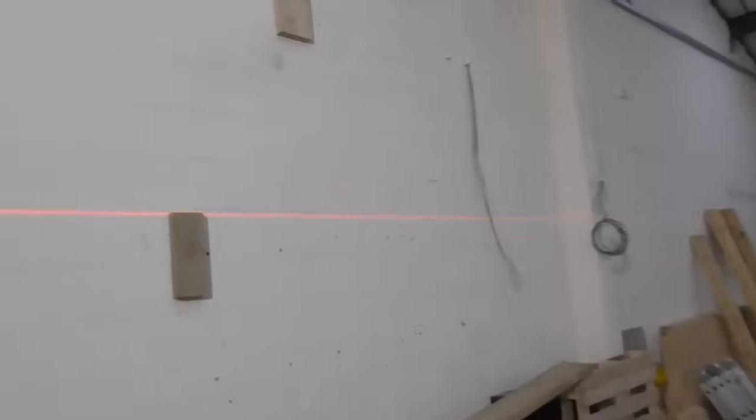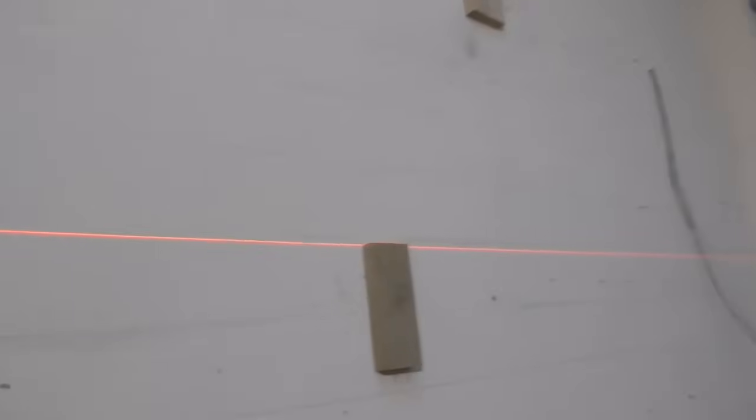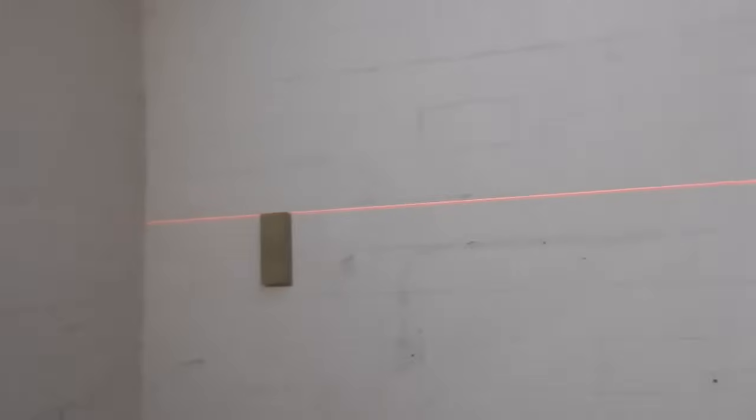Once we've done that all the way around, we'll come back and find the right positions to drill, because obviously we don't want to hit a perp joint or a bed joint with our resin. Then we can drill out for the resin, cut the bar and stick the resin in. So I've stuck a camera up on time lapse so you can watch us do a bit of that.